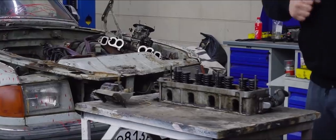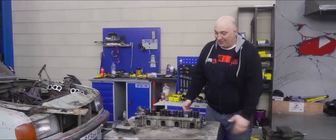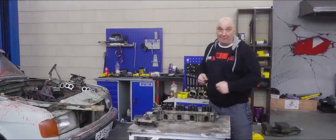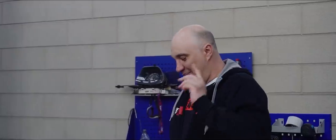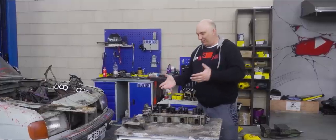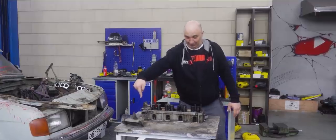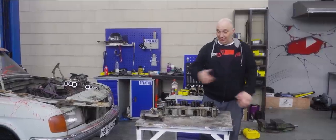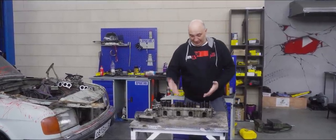So I was looking into how you can do it, and there's a ridiculous number of options. Some even use a jointer plane — we don't have one of those. But there is another popular method: you basically take a big sanding stone and for the next few days you are pretty much dying while grinding that damn head. But then I saw this other thing — how a few guys found a rather elegant solution. They took something along the lines of glass or stone with some sandpaper, then found a motor just like the one I've got right here, mine is for powering windshield wipers. A motor, a lever, a plate — and they dragged the head back and forth over that sandpaper. Being electric, it did all the work, giving everybody the opportunity to just go do whatever they needed while the head was being ground down.